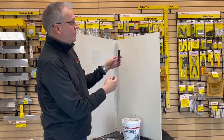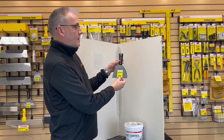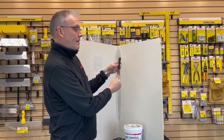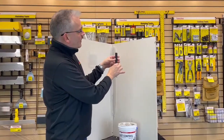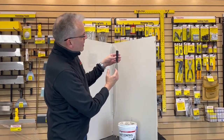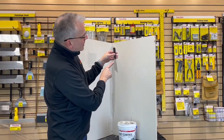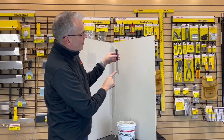This is a tempered carbon steel with a proprietary formula for how they heat and temper the steel, so it remains flexible without having memory. It's a very uniform piece of stamped carbon steel that was tempered, and then it went through a process called hollow grinding. Hollow grinding means they put it on a table and grind away material in this area — a certain amount — so it's thicker here, thinner here, and thicker there.